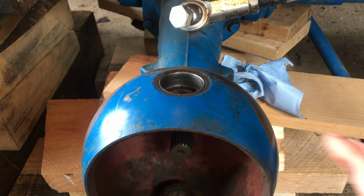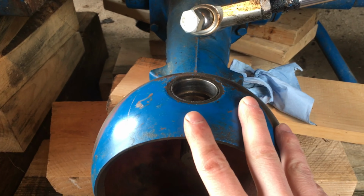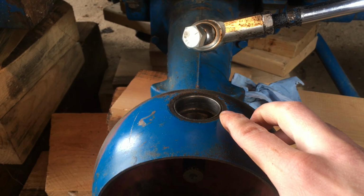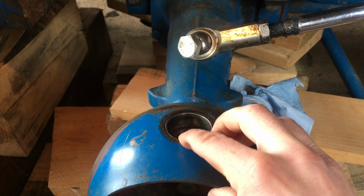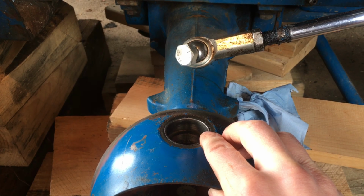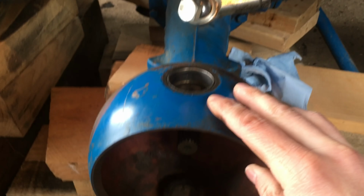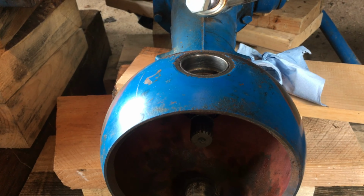All right, parts have arrived. I've checked it out, and what I got is good and all the right size and everything. So time to get these old bushings out of here. I don't have a bushing punch or anything, so I'm just going to take a metal blade in the Sawzall and try to get this broken and then collapse it on itself to pull it out. Same thing down in the bottom. I'll probably work from underneath.